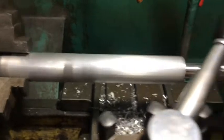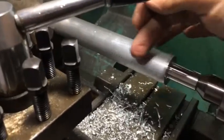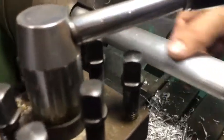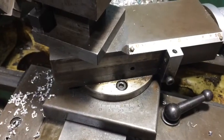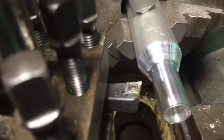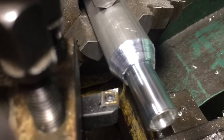Set up in the live centre, finish making the shape, thin it down. Put a bit of a chamfer here, make it look neater, make that thinner. I like to knurl them, but the boys like them smooth, so it suits me fine - it's much easier. I've changed the angle of the cross slide, which will give you a chamfered type of cut, but you can't do it on automatic, you've got to do it by hand. I'm not a machinist, I just do it and figure it out myself.